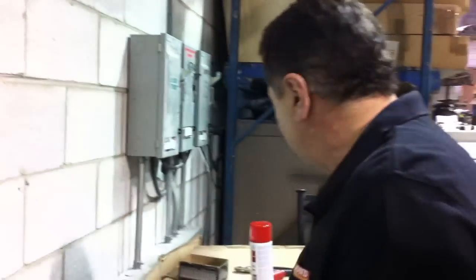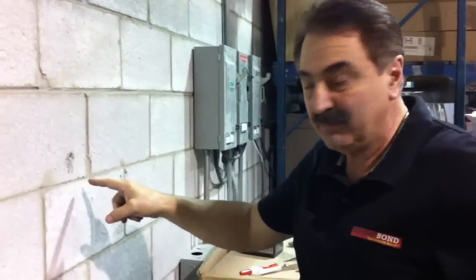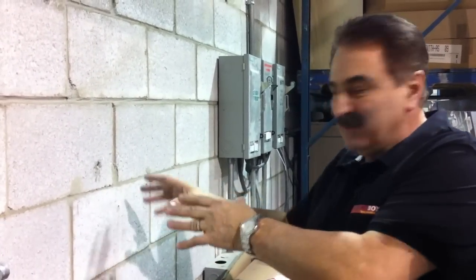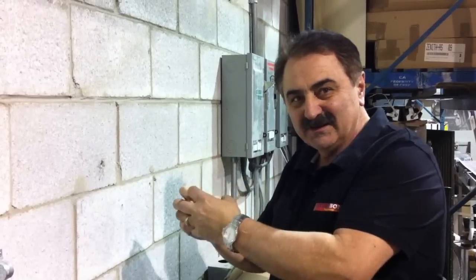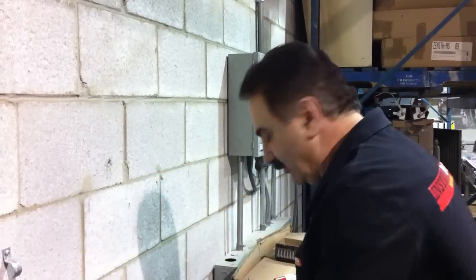But what I'll do is I'll put some more on top to do the outside of it. So now I've got myself a plug in there — a cyanoacrylate plug, which is superior to other plugs because it has actually formed an adhesive bond to the block. So it will not come out.